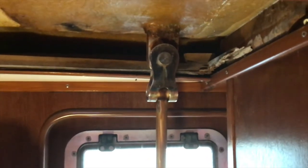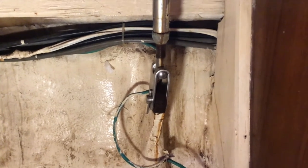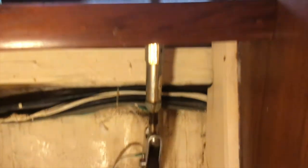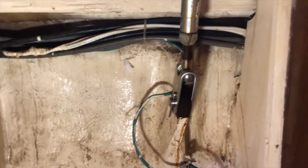So to give you an idea of what I've got to do, this is probably the worst example of a rusty one. That whole rod has to come off. It's got to all get ground down, get all that rust off, get all the rust off of those threadings, put lanolin in it and get those threadings to where they'll spin really easy. Just clean it up, get all that rust off, and then coat it with grease like on the other one and move on. So this is the worst one.